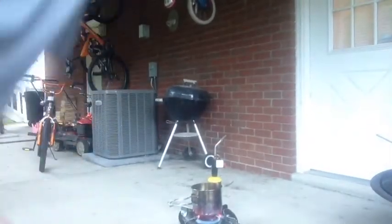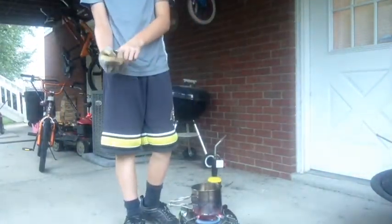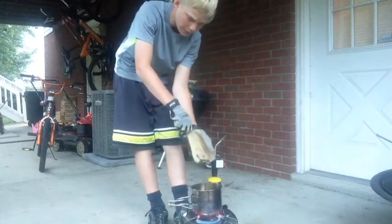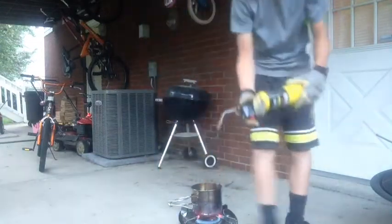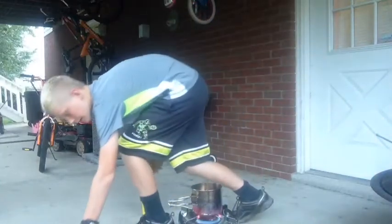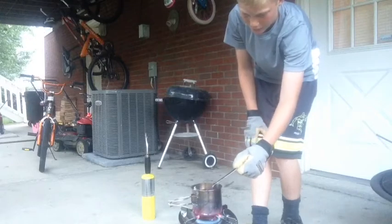As you can see on the side, there still is a decent amount of it on there. So I'm going to get that off and then keep adding some more cans. So my gloves back on, try to scrape that part off. Right now, the slag on the side is probably starting to harden, so I'm just going to take my blowtorch really fast and hit that just enough that it will slowly start to droop. And once you get there, just spoon it all up.